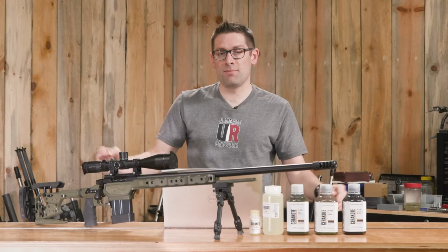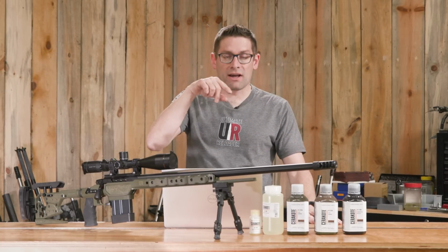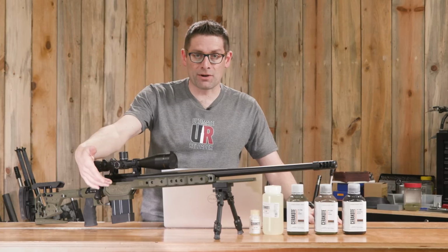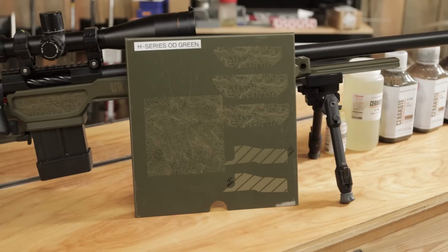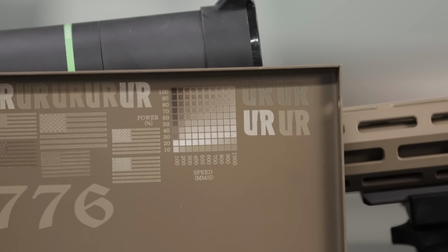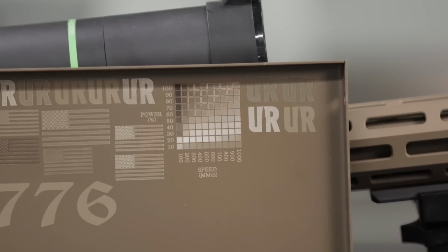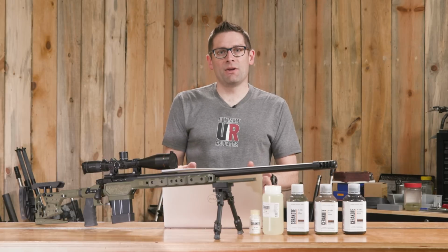The laser is going really fast, like 2,500 millimeters per second. That's like 2.5 meters in 1 second. It's really going really quick at a really low power level to discolor and burn the Cerakote to a different color. A lot of different shades. You got to do a lot of experimentation, different line widths, different speeds, different frequencies, different power settings. There's little grids that you can burn onto Cerakote test sheets, which is kind of what I did to arrive at this stuff. And once you've got it dialed in, it's time to go.